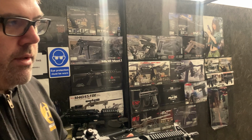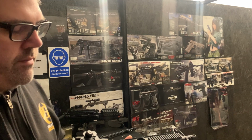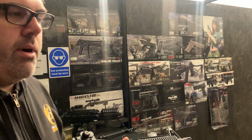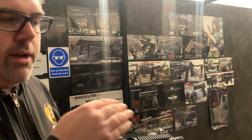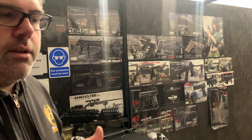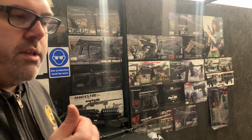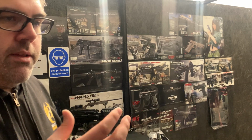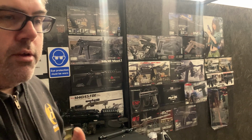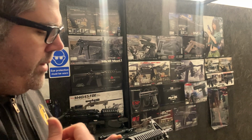It gives you a lot more leeway before there's that potential chance of having that lockup. The lockup's basically governed by how long it takes to cycle round before you try and start another cycle. If you try and start another cycle before it's finished, then that's the potential time for lockup. Making things go faster, making things take less time, all help with stopping lockup on these. Fitting a gate MOSFET is another way to completely avoid it.